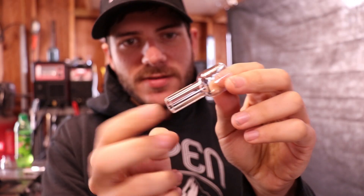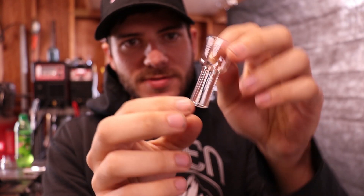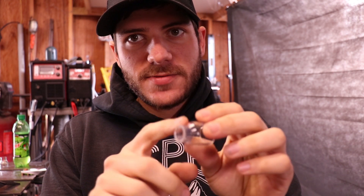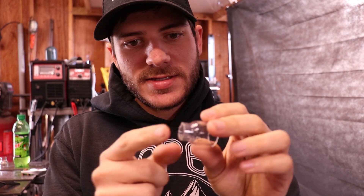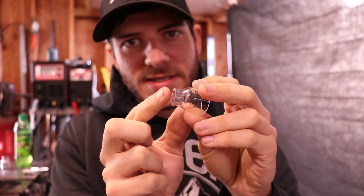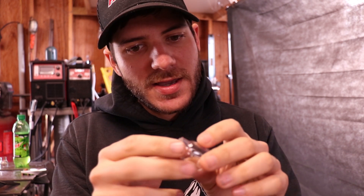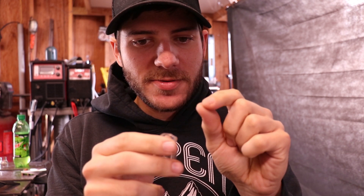I also used this number five XL. It's real long and tapered so you can get down deep into things. Normally I use just a standard ceramic cup, but the reason why I like this is because I can leave my tungsten just barely sticking out and still see what's going on because of the glass. Because of that, I can turn my gas flow down a little bit. If you have it further out like with the ceramics, you need to bump it up just a tiny bit.